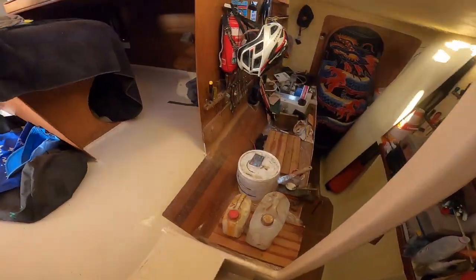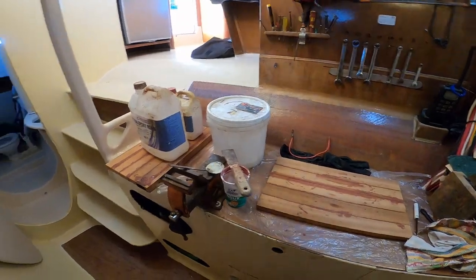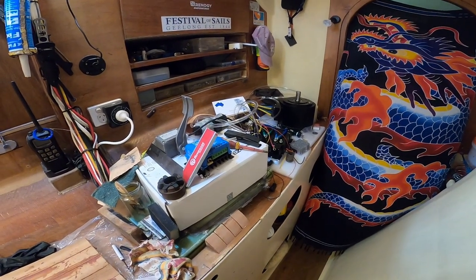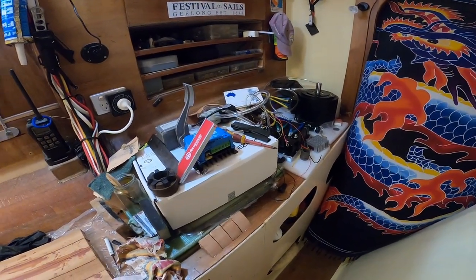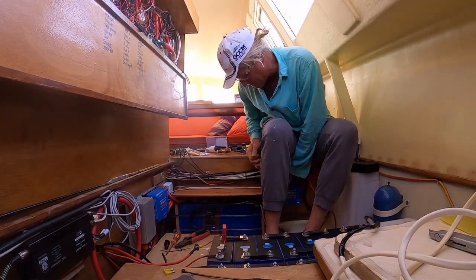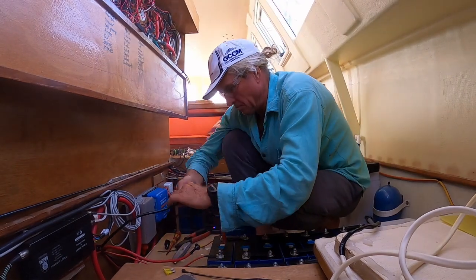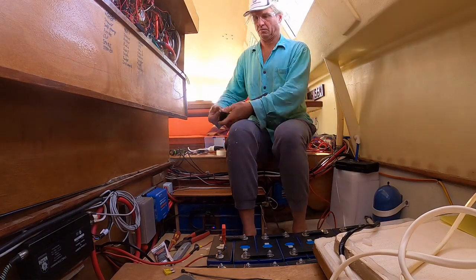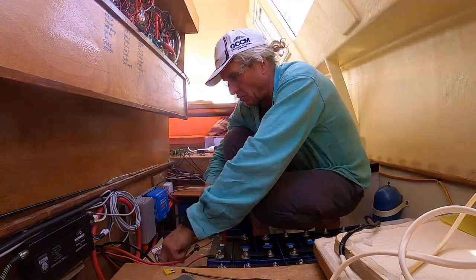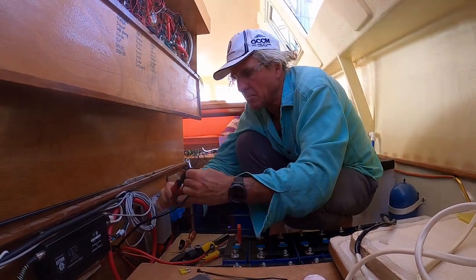Down here I've been setting up the battery ends to compress the batteries. I've laminated them up and I've been puzzling away with the electric motor a little bit, putting all the pieces of the puzzle together. While LiFePO4 cells are very stable and safe, the key issue is ensuring safe wiring practices. The amount of power this type of battery can discharge is frightening. So when working with them, I approach them like I would a shark or a lion in the wild, with great wariness and respect. Spanners and tools should be carefully insulated, safety glasses worn and rubber gloves, while each move should be carefully planned out.